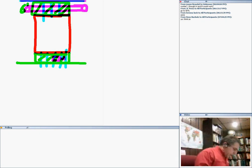Sprinkler protection shall be permitted for the dedicated space where the piping complies with this section. So if I have a sprinkler head coming in here, guys, no problem, just the sprinkler head. Okay, one more time. Any questions, guys, about dedicated space? Dedicated space, my friends, any questions? Equipment space is for equipment. Working space, obviously, is for working adults like you and I.